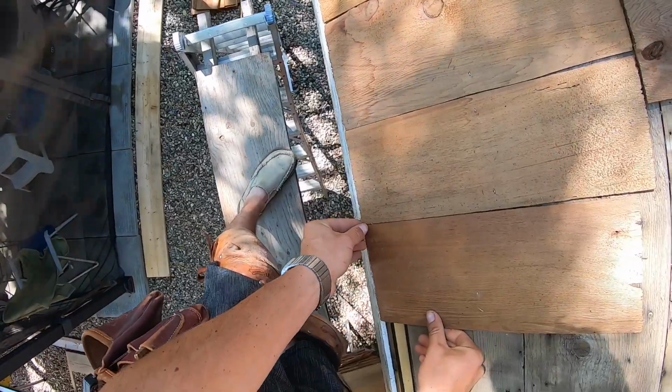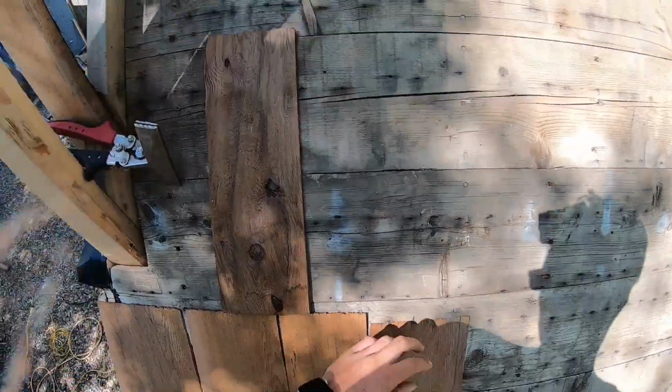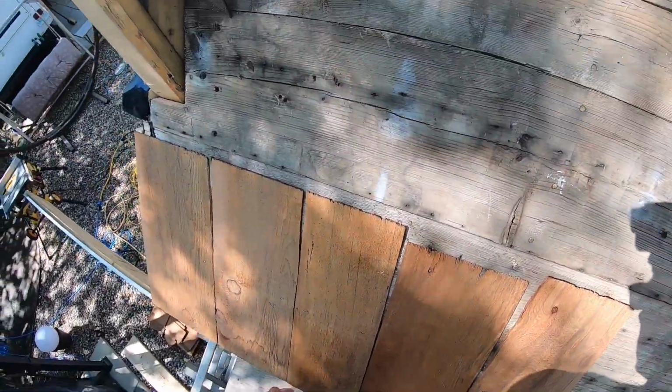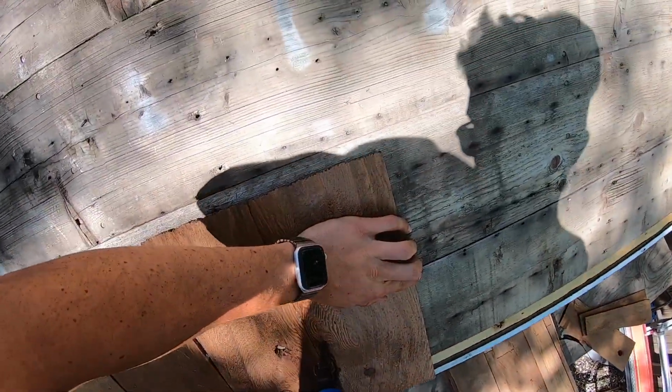And I mean, for what it is, just an old saloon, works just fine. And my method of fastening here, I'm just using a narrow crown staple. Really, it should have the same holding power as a shingle nail, and it's a lot faster. To drive all these by hand would be quite the task, and I'm really running behind schedule here.